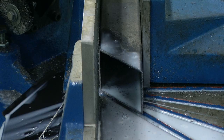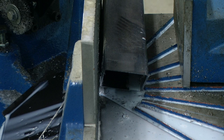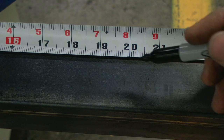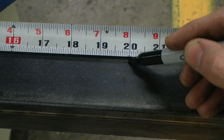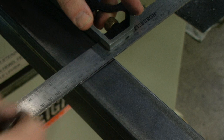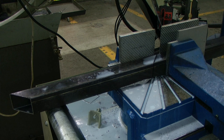This cut could also be made on a miter saw with a metal cutting blade. For the second cut, we're going to keep the saw at the same angle but rotate our material 180 degrees. Our overall length is 20 inches, and we will be identifying that on our square tubing. Using a square, I'm going to extend my line and identify my angle of cut so I don't get confused when I'm lining it up in the saw. And after clamping it securely, we can make our cut.